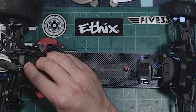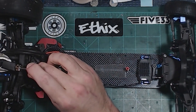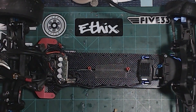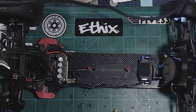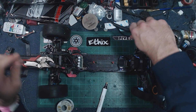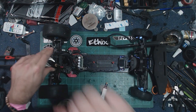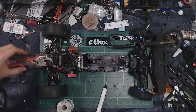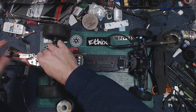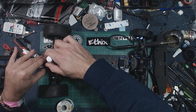There you go — a good solid connection. It does not need to be completely filled with solder; you just want things to be shiny so you don't have a cold joint. The connector is barely warm, which means I did a good job applying just enough heat.